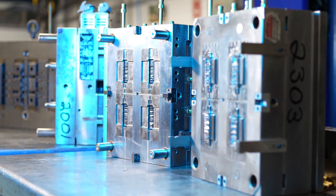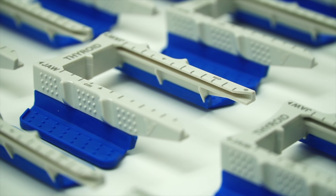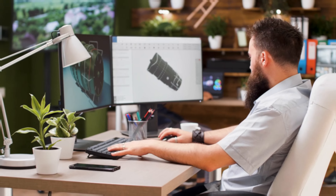For example, does the part have a consistent wall thickness, which ultimately allows for consistent part cooling? Does the part have any wall thicknesses that are too small and may be difficult to fill as a result? Does the design allow for appropriate 1 to 2 degrees of draft so that the part can be easily ejected from the mold?